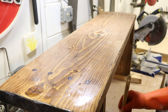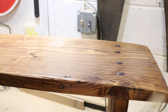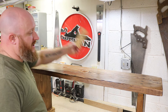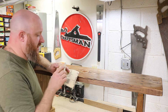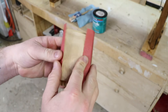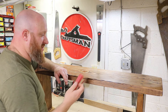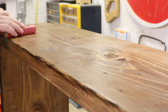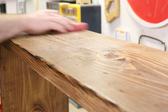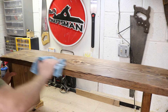I've got the stain and one coat of my polycrylic — I really love using that stuff. What I want to do now is sand between coats; I'll probably put several more layers on. I'm going to take 220 grit, wrap it around a little block of wood, and go over the surface lightly to keep it level. For little grooves and spots I might use my finger to get it smooth. Once it's smooth, I'll wipe it down with a dry rag and then put more polycrylic on it.